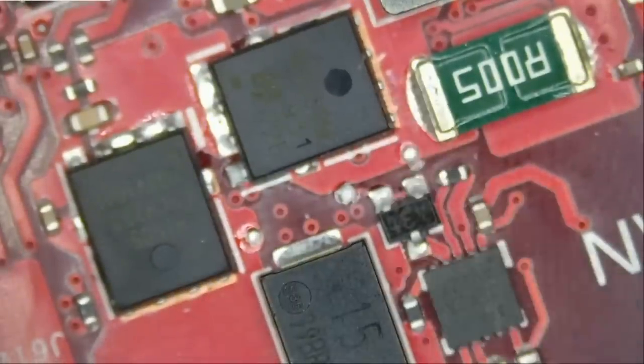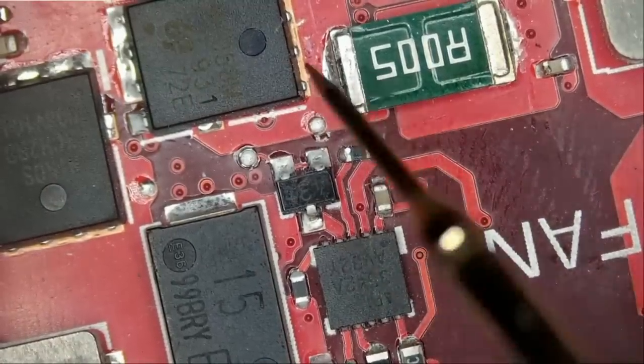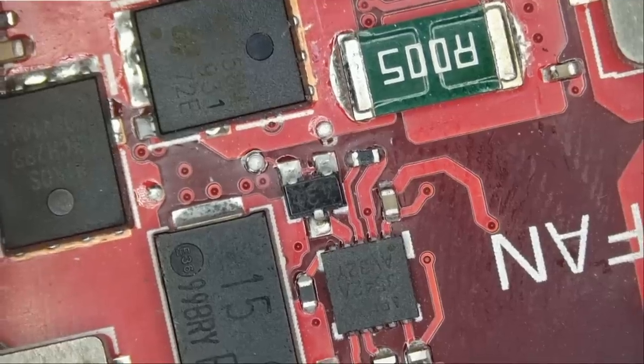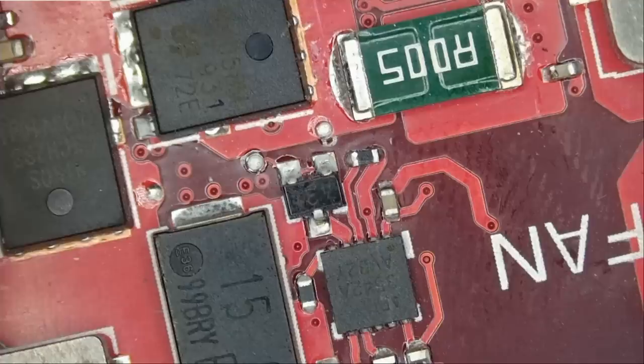Disconnect the cable. And now there's a piece of circuit board that plugs in from here all the way to right here. And I'm interested in the drain of this MOSFET, if we have a short, meter in diode mode. And are we gonna hear a beep? And yes, we have a short circuit. Very nice. Hopefully this board is a fix. Otherwise, we're gonna have 3 unfixed boards in one video.